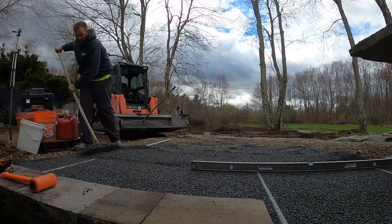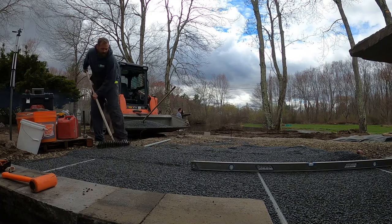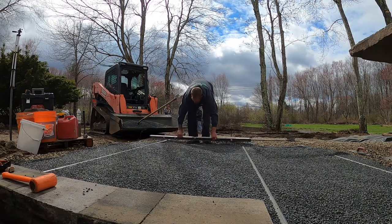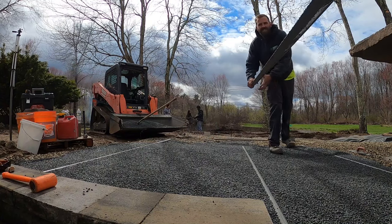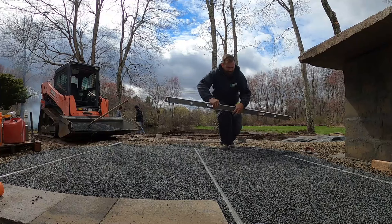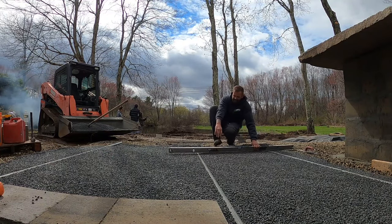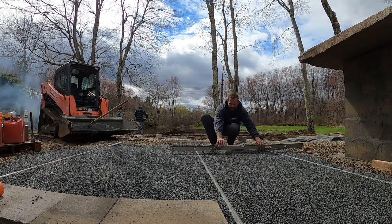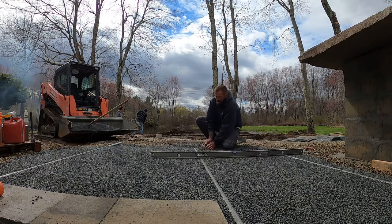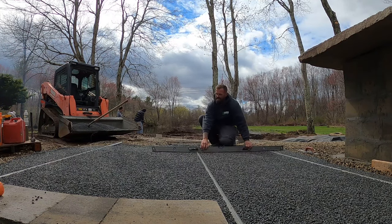And just a little trick, most pavers are about the exact width of the level that you use, 2 3/8, and that's a good way to see where you need to be. But this is what I do. I use a 6-foot level. I will be getting a couple screed levels in the future, but they are expensive, and the 6-foot level works perfect. And I've used it a lot of times on patios, but we use chip rock on top of our open grade base.